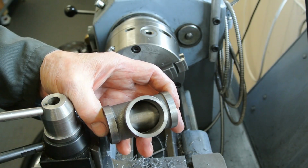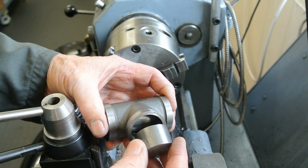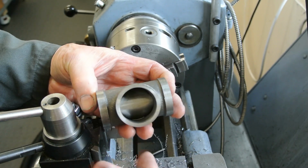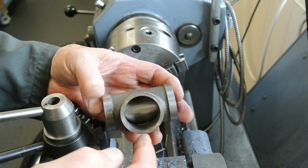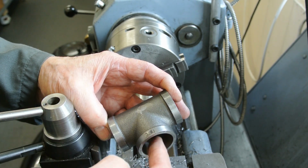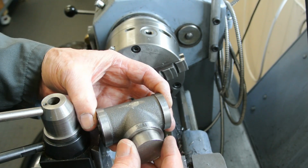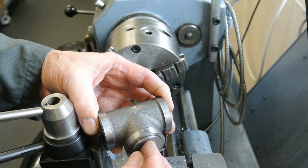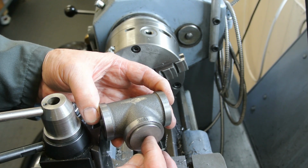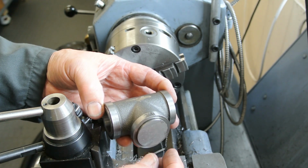Now I've machined this off, this plug, which is just a little bit, I think, too short, because where this sticks out, I'm going to use this as a reference point. Obviously that's dead vertical, and this needs to be 90 degrees coming out this side, so if these two surfaces are accurately machined, putting that in there, and it sits on it, will be at 90 degrees, and then whatever's in here, bored the same as I've done this one, should be at 90 degrees as well.